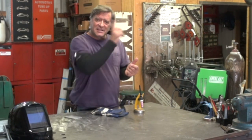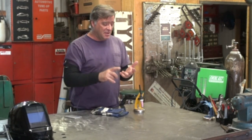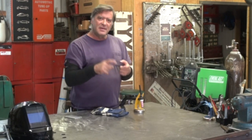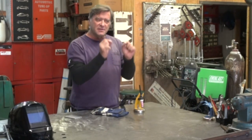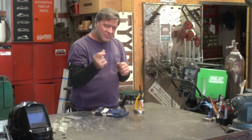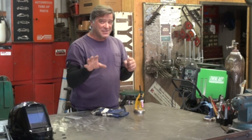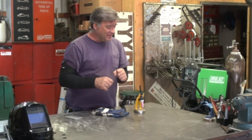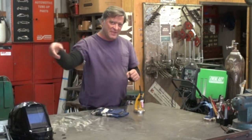The sine wave, like I say, that's like the old-fashioned machines. I'm not really sure why you would want to use it, but that's why I play, that's why I practice. And then the triangular — that's really kind of cool. That's for thinner aluminum, for vertical joints or overhead joints, something where you want to be able to hit it quick, get a puddle, add your filler, and have that puddle freeze just right so you don't have to worry about it dropping or falling through. It's kind of fun to play with. But let me fire this beast up and get it set just right, and then we'll just run four little beads, switching from one wave to the next so you can see what they're like.